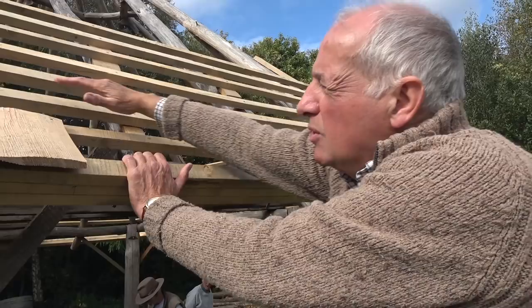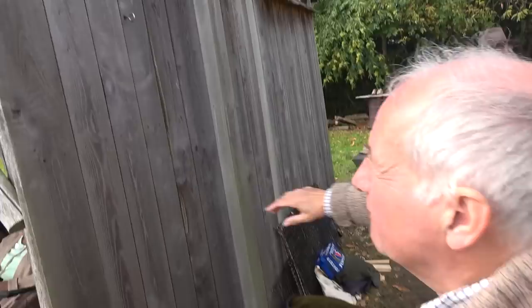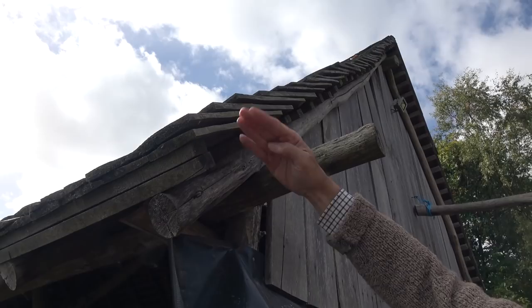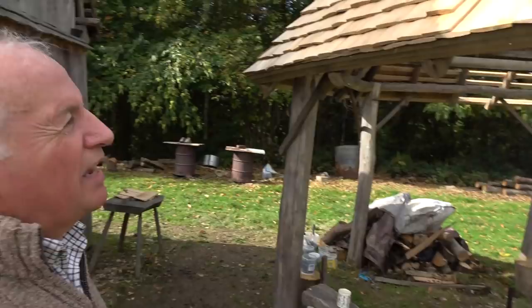That also stops it catching the wind, and the water doesn't get blown in either presumably? That's right. The next tile will go on top of this. A good example is on the traditional two-sided roof here — you can see the shorter tile and the full tile going through. The bottom one's kicked up, which keeps it tight, and it does close up the gaps. So that's an important feature of the battens.